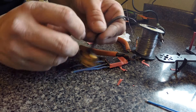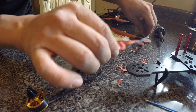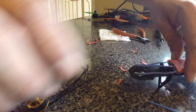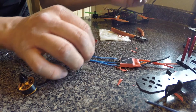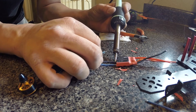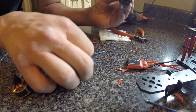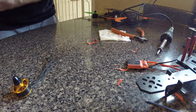Before we weigh it down, we'll desolder these leads from the board. With a hot iron you just want to take it and give it a little pull pressure and those are gone. That's how simple and quick that part is.